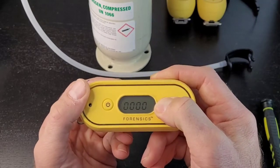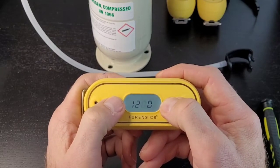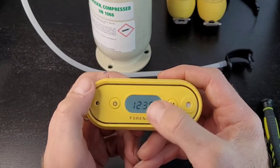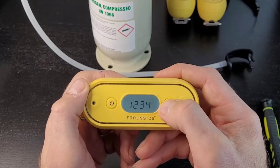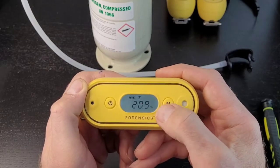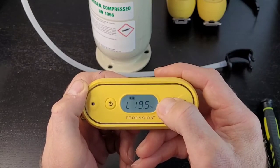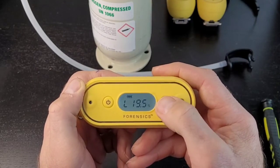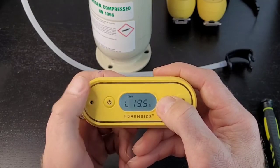Press it down to go into the menu options. You have to put in the passcode: 1, 2, 3, 4. I'm using the menu button to select through the digits and the power button to change each digit. To enter, hold the menu button for two seconds. Now it shows L, H, Z, and C options. If you want to zero calibrate, that's what Z stands for; if you want to span calibrate, that's C. I'm scrolling through — to select one, hold down the menu button. Assuming I want to change the low alarm level from 19.5 to 19: hold it down, it starts to flash meaning I can edit that number. Scroll through and use the power button to change the digit to 19, then press enter.